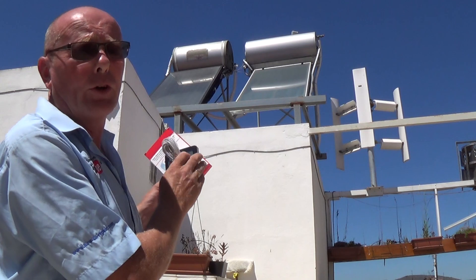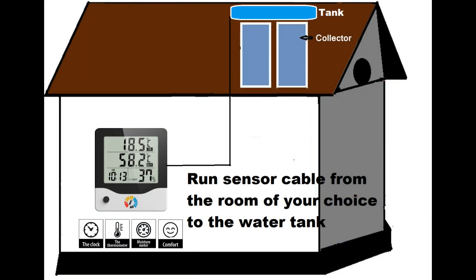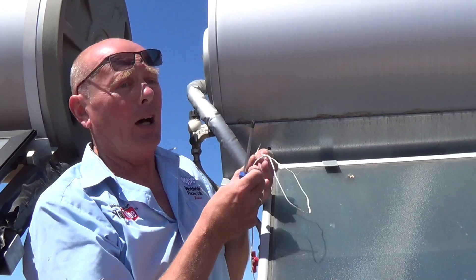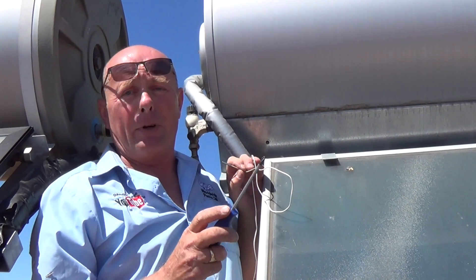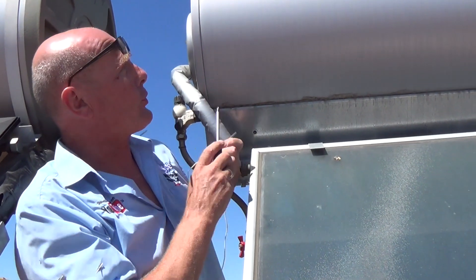Allowing for one or two degrees drop in ambient temperature. I won't go into the fitting of the cable in detail, but you want to install the sensor in the room you require and then run the cable through to the tank. We've threaded the cable all the way from the bathroom — I've installed the actual monitor above the bathroom door. Now we have to insert the probe into the tank.